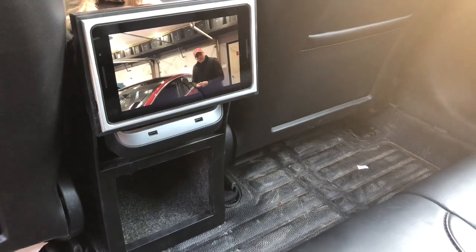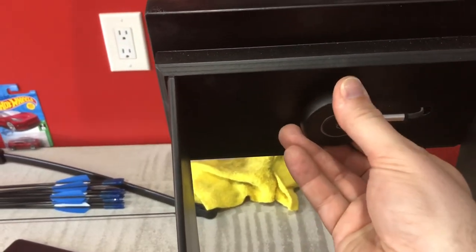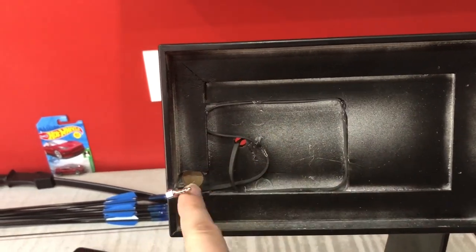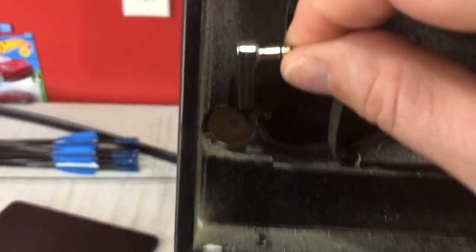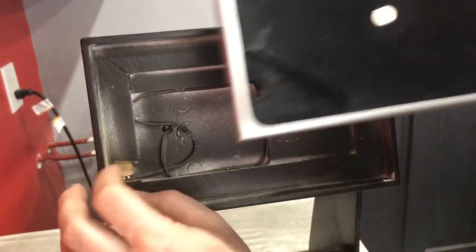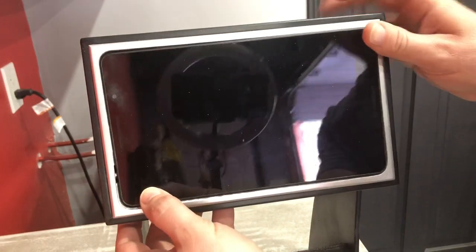With all that paint dry, here is the project in the car. Look at that. You can see it's very easy to get in and get out — that's the nice thing. We can use this on long trips, though it's certainly not going to be used on a day-to-day basis. This pops right in, and I've had it in for about a week now and it doesn't really move around much at all. That little circular device is a Bluetooth transmitter — it's connected via mini-plug to the audio output of the tablet. The wire itself is just connected with some hot glue, and that area I routed out earlier is where the wire is held to keep it away from the tablet. As soon as you connect it, you have the option of multiple headphones being connected at one time, so both my girls can listen to whatever show or video game they want. It just plugs into the tablet, squeezes in no problem.